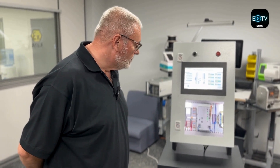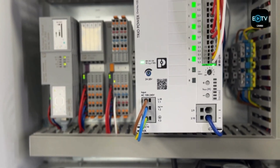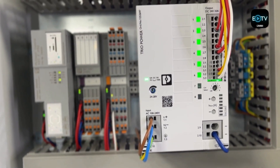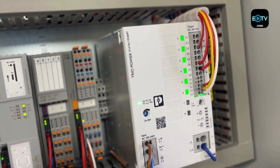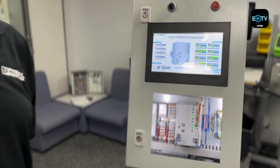This is the new Trio 3 power supply with integrated circuit breakers. There are eight electronic integrated circuit breaker channels, each of which is configurable from 1 amp up to 10 amps in various stages: 1, 2, 3.8, 4, 6, 8, 10.